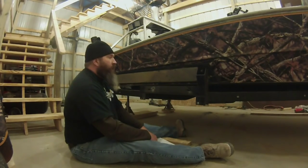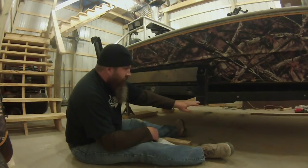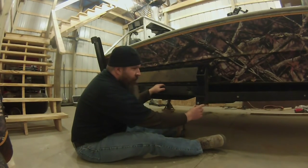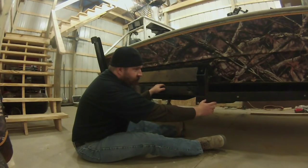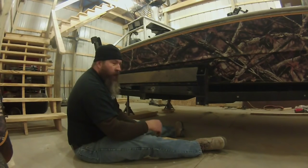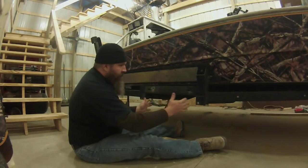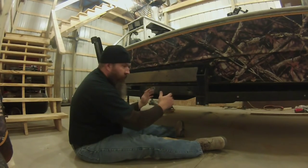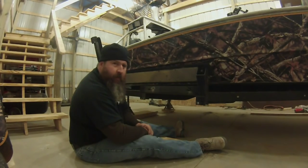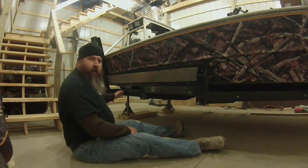Okay? With the spring hanger kits, like I said, I'm gonna go ahead and lop these off. I can move my spring hanger out here just at least a little bit before I lose the taper of the trailer and still be fine. And for me, that's gonna work out just perfect, because that's gonna move my front axle from where the old axle used to be. It's gonna move it forward about 6 inches. And I think that's gonna be really good for my setup. And then my second axle will be right back here.